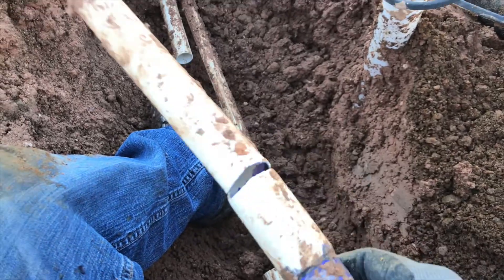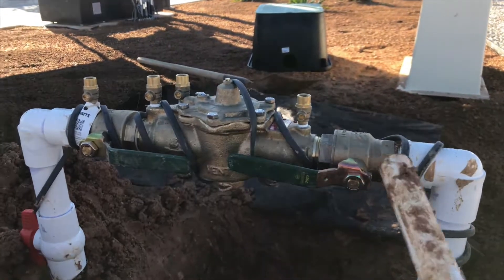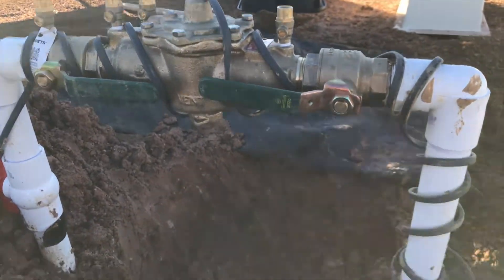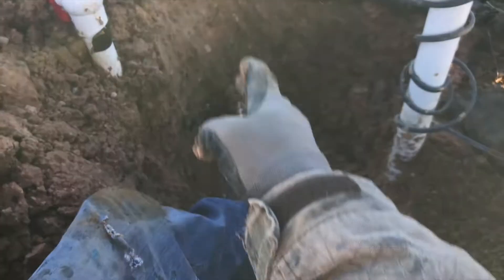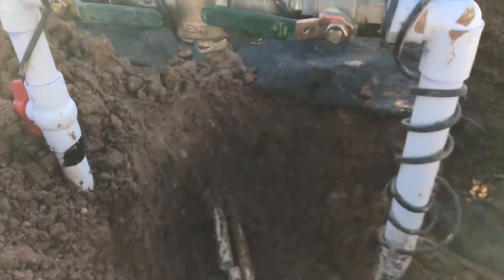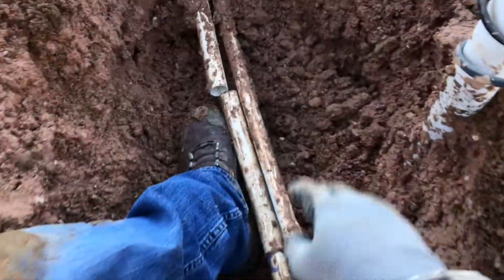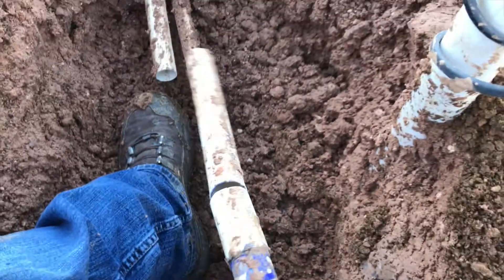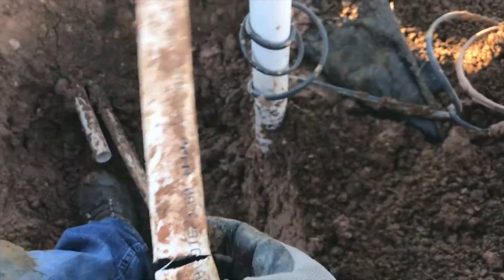Let me show you something. We had a leak right here, just dug it up, and this pipe had flooded the entire area. This pipe ran right here — it's actually an RPZ that runs to the building, added later. When they dug it all up our irrigation lines were already run through here. When they filled it back in, dirt got packed on this pipe and it ended up cracking it right at this bell end.